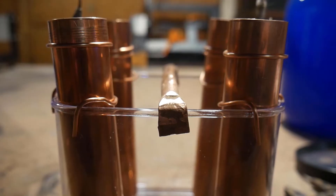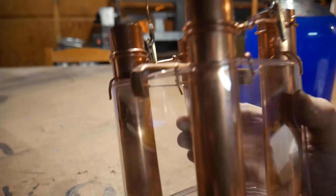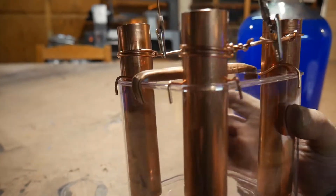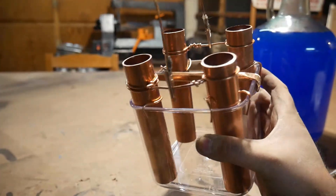For the cathode it's pretty easy. Just get one small copper pipe, quarter inch at the thickest, and flatten the edge to run it across the middle of the tank. This is what we're going to use to suspend our parts in the bath. Any thicker diameter and it's going to be hard to take in and out. Fill it up and the tank's done.